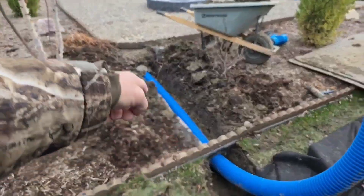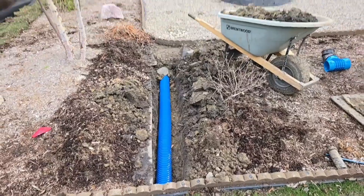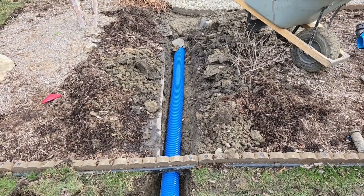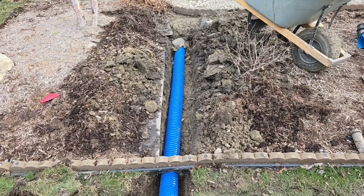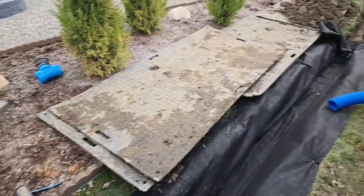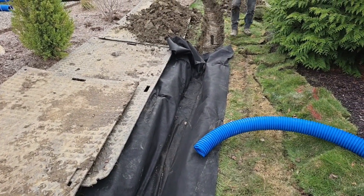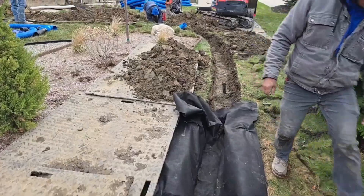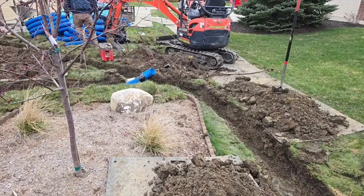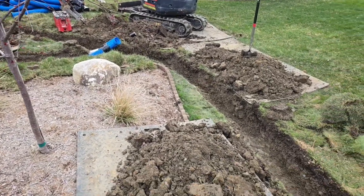When we put in a french drain we haul away all the dirt — that's why our french drains work as good as they do. This solid line is for a catch basin right there catching bulk water. They're going to put the dirt back on it because it's not a french drain and it's not a perforated pipe, so they're not going to put fabric in the trench and they're not going to put stone around it. Over here you can see where the french drain ends — they started keeping the dirt because it's a solid roof runoff system line. Solid pipe typically doesn't get stone and fabric.